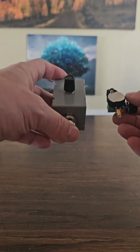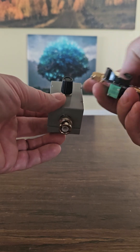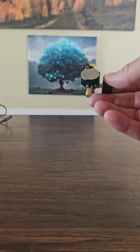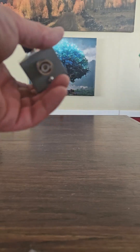These are active attenuators — they do the same thing, go in-line, and you turn them on and adjust the dial. This one has specific instructions: you tune four megahertz above the signal. This one is by Arrow and works quite well; this one is from Bionics. I think the Arrow one works a little better, but both are options for active attenuation.